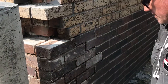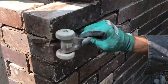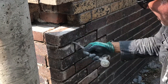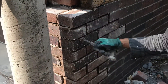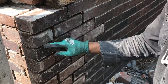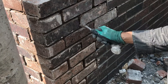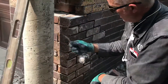We'll aim him back towards this guy here, call it good, and then let's go ahead and rake the mud back. We want some depth in these joints to tuck point them, so we'll come back with a colored mortar in about an hour and grout this in. I dig these back so I've got at least a good inch on the joint — three-quarter to one inch depth on the bed joint — and the head joints have all kinds of room. Once I tuck point this in place and brush it down, we'll be done for the day.